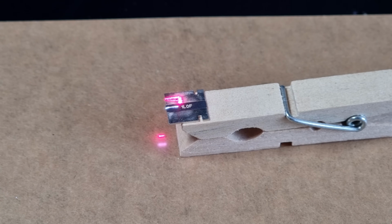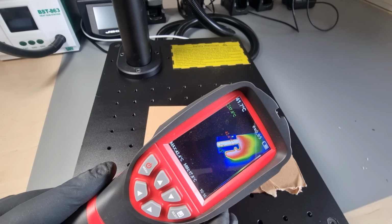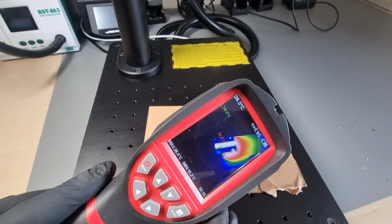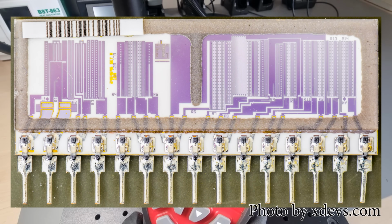For example, precision resistors receive careful annealing after manufacturing. If one gets massively overheated again after that, its properties are permanently degraded. Trimming of a current shunt in circuit would probably only take it to 40 Celsius, which is great. A lot less detrimental than 280 degrees C reflowing. Although the most immediate neighborhood of the cut might suffer a bit. That's why resistors made for laser trimming use these stepladder patterns. When a rung is cut, almost no current is going to go in there anymore, and experience the degradedness of the area.